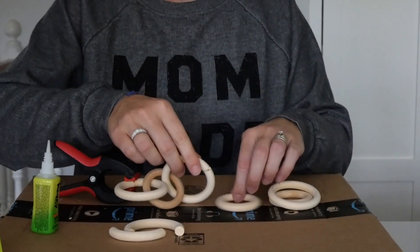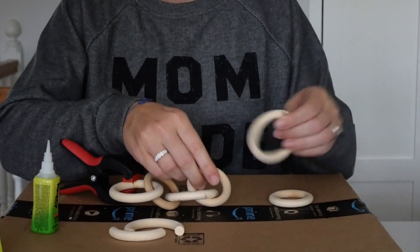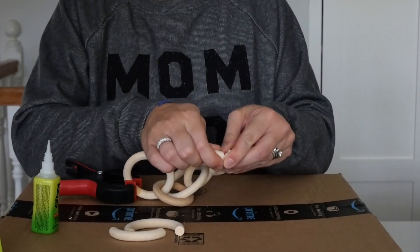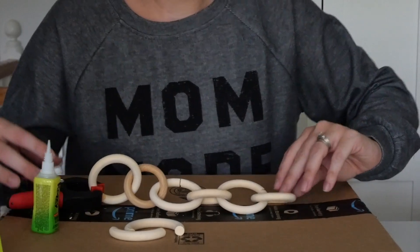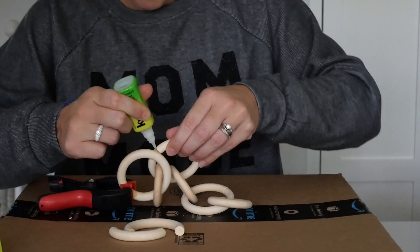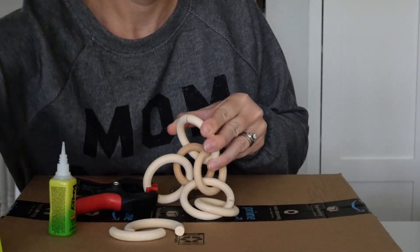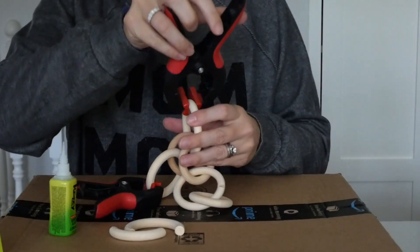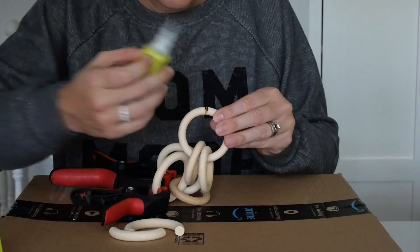I'm going to rebuild this using the whole pieces because you only need to use one to get on both sides — that's way better. We have a lot less seams to do. Now we have only four seams instead of seven. I'm going to put some glue in there and get a really strong clamp on it just to hold it in place, because the wood has gaps in it. I'll show you what we're going to do to fix the really big gaps.